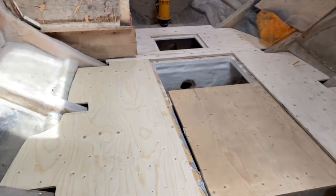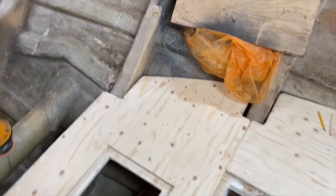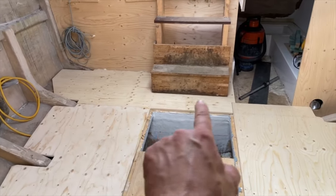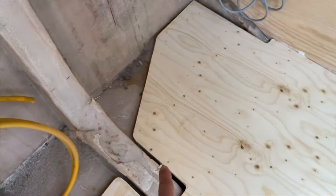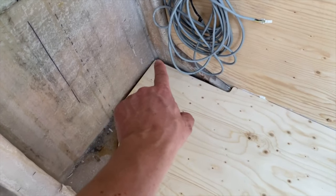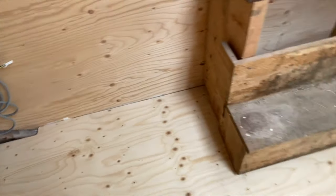So we have a complete floor. So we put the front piece in here, which obviously we'd already made before and laminated. And obviously this piece was already done and laminated. So we've added the back piece here now. So that's all nice and shaped to the hole there. So again, left a nice gap here around the back. Probably just need to trim that back corner actually. That corner's been left, so we'll just jigsaw that little radius off there. But other than that, it fits really nice.